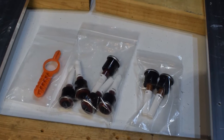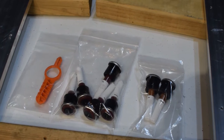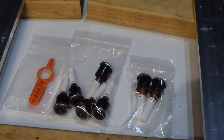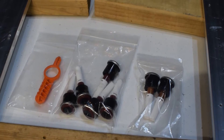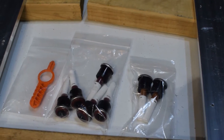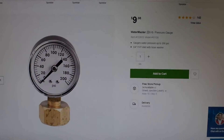Enter the MP 1000, the Hunter MP rotator. We've got 90 to 270 degree, and I think they're the smaller 8 to 14 feet range. I have two right-hand corners, the MP 1000. The Hunter ones adjust with that little orange adjustment tool. That's one thing about the R-Vans — the Rain Birds — you can adjust them just by hand; you don't need a special tool. Had I measured my water pressure beforehand, this probably would have saved me some trouble.